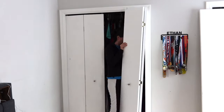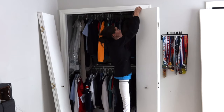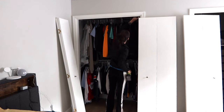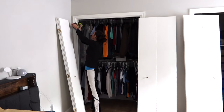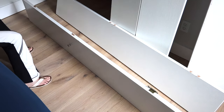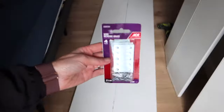The first thing you're gonna do is remove the doors. For me it wasn't that hard because half the time they don't stay on the track anyway. You want to remove the rollers on the top and bottom of the doors, and you can see where I'm removing the track from inside the door frame. Once you've taken the doors off the track and removed the track, go ahead and remove the hardware and any knobs currently on them.